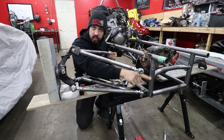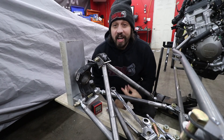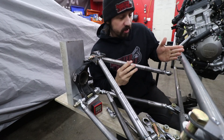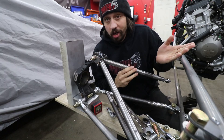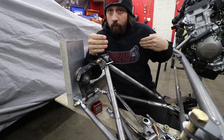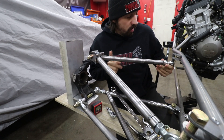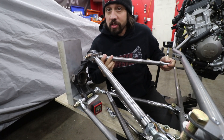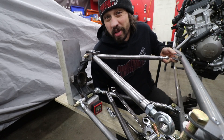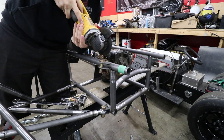What I think I might do is mount to this upright bar here and add another upright bar over here. The other thing I learned is that having both bars mounted here — when I adjust the heims in and out because they're not parallel, the mounting points either shrink in or out. So what I'm going to do is mount a heim on this side of this bar and this side of this bar, so this top bar is adjustable on its own and then this one will be adjustable in and out. Is it going to be perfect? Probably not. But is it going to work? Probably. I'm so sorry to the work I've already done.